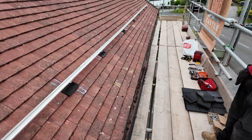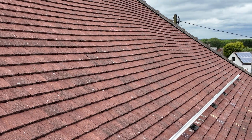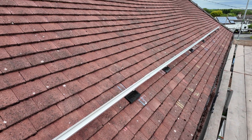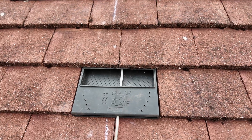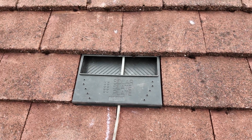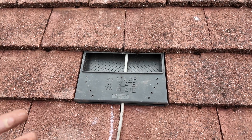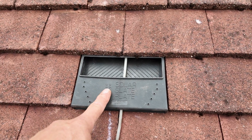The rails are on. You can see that roof over there — it absolutely bellies out. Unfortunately with this system we have no height adjustment for the brackets, so they sit on the rafters at whatever angle and height the rafters are at. We have sneaked one Eric tile on — purely because it is still a great way of getting your cables onto the roof on a plain tile or Rosemary tile roof. It's a superb solution, and even though we've used an alternative product for the actual roof mounting system, the Eric tile handles cable routing and that's why it's still in use.